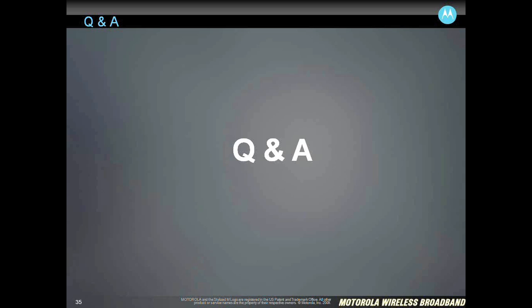But these products will operate, the subscriber modules will operate with 24 volts. So that typically would be like two 12-volt batteries in series, or the AP will operate at 48 volts as well. So there is a possibility there, and we do have customers that have deployed it in those situations. But we found that each case is unique, and we can't really give a cookie cutter or a turnkey solution for that.